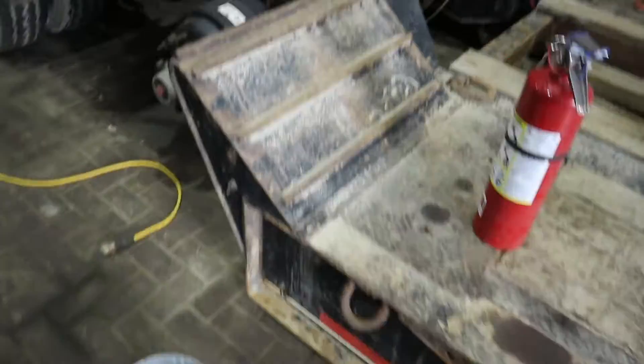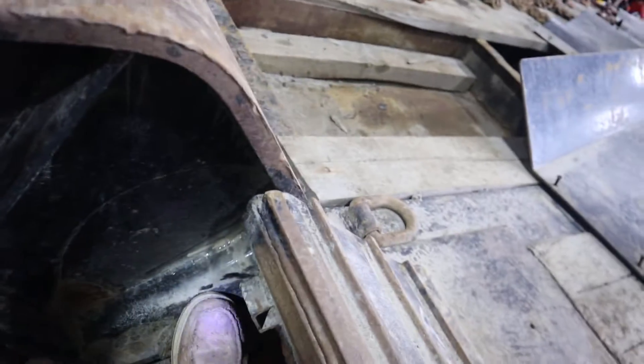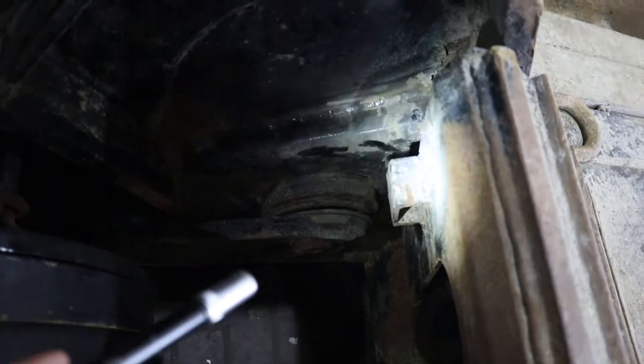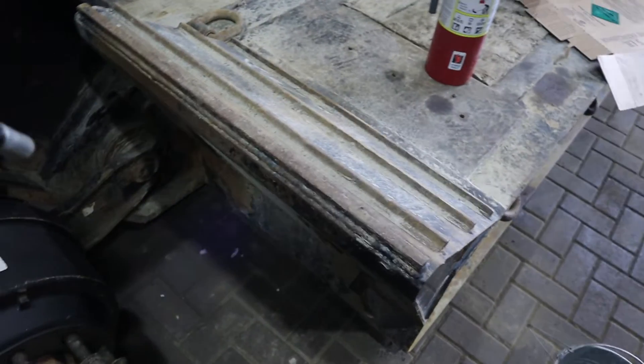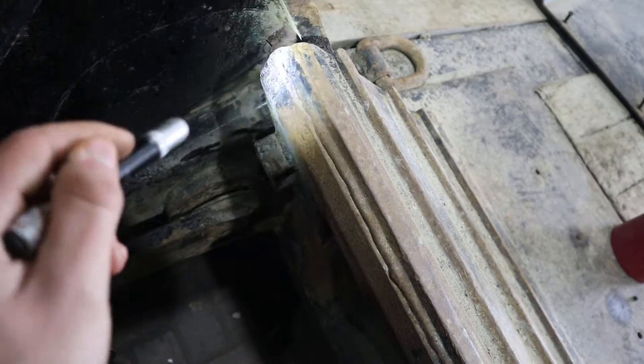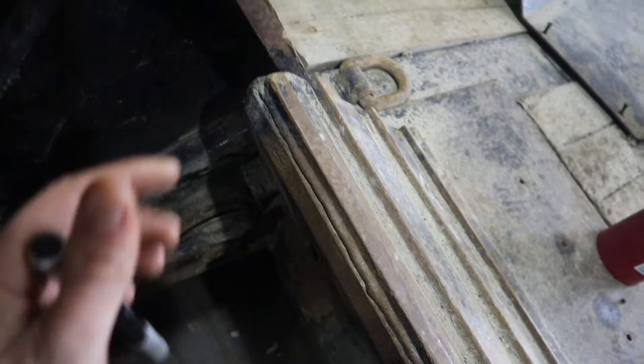Today at my customer's storage shop, they have a low boy with a cracked frame. It's a really hard spot to get at — it's basically the support for the rear axle pivot point, and that support is cracked. But there are ramps in the way, so instead of taking the whole ramp off, which is a lot of work, I'm going to carve a section out so I can access the crack, gouge it out, weld it, re-plate over it, and figure out how to prevent it from happening again.